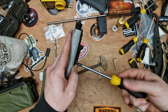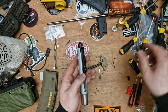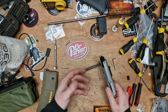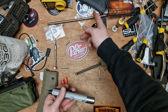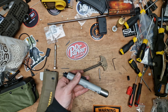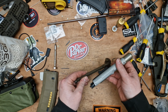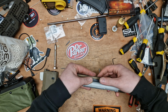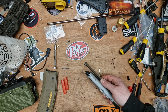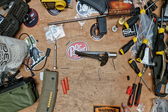All you need is a couple of small drill bits, the tools to take your bolt apart, and a little 3mm grub screw. The first one I found, it was just on the bench. The second one I found in my AAP 01 bits box, which is over there. So we're going to test this now. Now, it might not be set up. The first time I put it in the spear, I just wound the screw in and guessed. And it went straight down to 0.6 joules. So you've got a hell of a lot of adjustment on it.